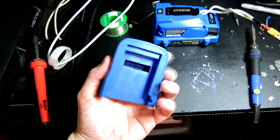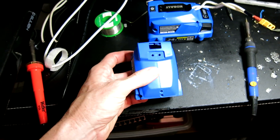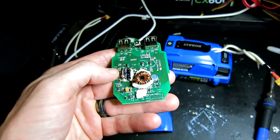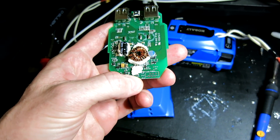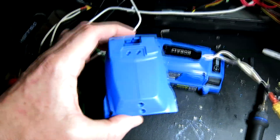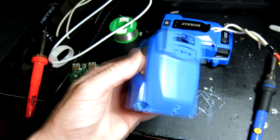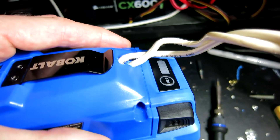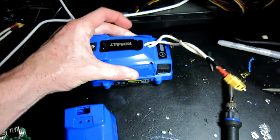The reason it looks like an empty shell is I gutted it — I took out the motherboard inside, which I'm holding right here. I took this out before drilling because you're going to be drilling right into this section, and if you hit one of those little fuses you could ruin your USB ports. So I took the motherboard out, screwed the Torx nuts back in so it's connected, then drilled in right at the indentation so the wires come out and the belt clip is not blocked.